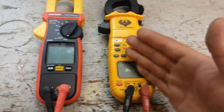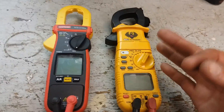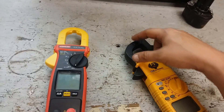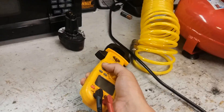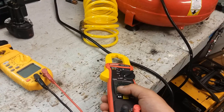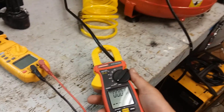I've loved this meter — it's been a great meter. It's got those little extra small things, but this one has the important things, and the important things weigh out the small things like the magnet or the probe holder on the amp clamp. The no-contact voltage on this one you have to press Select twice and it gives you a beeping telling you there's power there, or you can clamp onto it. On this other one, the probe holder also lets you use it as a no-contact voltage probe — so you can hold it over towards power and it beeps.